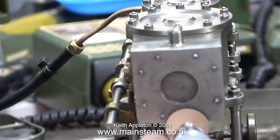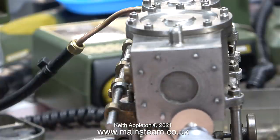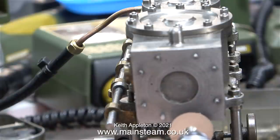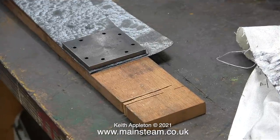Now I'm going to make a special stud with a slightly longer thread at one end. I'm using a needle file to mark its length, after which I removed it and threaded the other end to level up the studs so that they look right once the engine is put back together. I used a polishing disc - these pieces of dental equipment are quite abrasive. Here's the story so far: all the studs are now the same length.